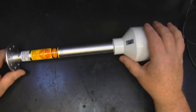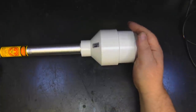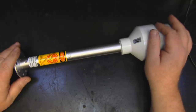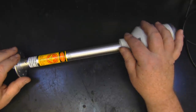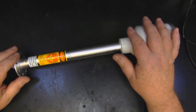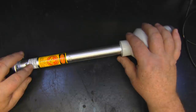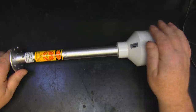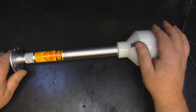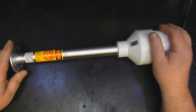Taking a quick look at the outside: as for the dB rating, the elements on their own will probably work out around 7dB, maybe even only 6dB. But because we're using it in conjunction with a dish, that's going to jump up significantly. The original advertisement rated it at 24dBi, and there's a sticker on here saying 30dBi. Around 25-26dBi is not out of the question with an average dish.